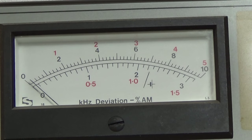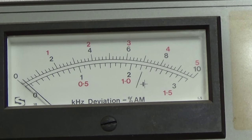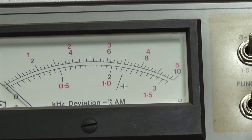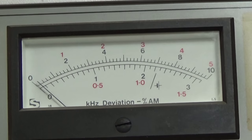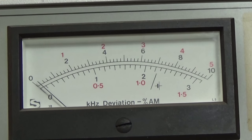Now we will check for AM modulation. Scale end is the 10 here, and that means 10 is equal to 100%, and let me increase the level here. Okay, and now we're going to check. Wow, it is 82, so that is definitely more than what we have seen with the Cobra and some other radios. For a legal radio, AM modulation above 80% is not too bad, but it could be increased up to 90, whatever. But anyway, it is higher than a lot of other radios we have seen, so not bad.